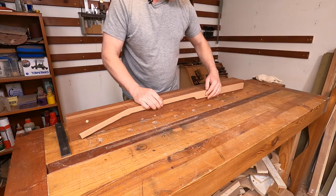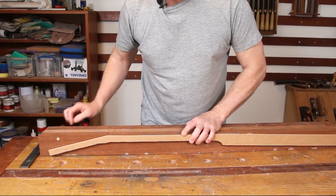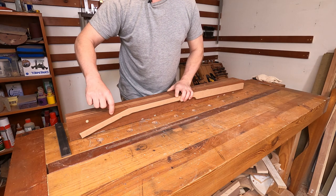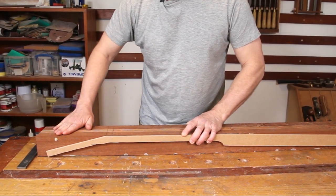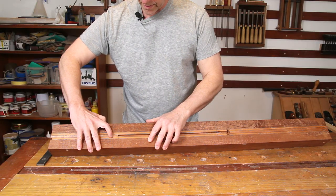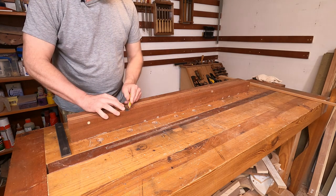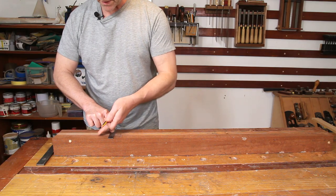I've got my template already laid out, however I'm not actually going to go with the headstock angle on this occasion. Instead of using the 14 degrees that's on the template, I'm going to mark this with a protractor to 10 degrees and cut that. I've marked in my nut line - that's the start of the fretboard where it meets the nut. The first thing I need to do is come back 4mm from there and square a line in, which will allow for the thickness of the nut before we start that headstock angle.